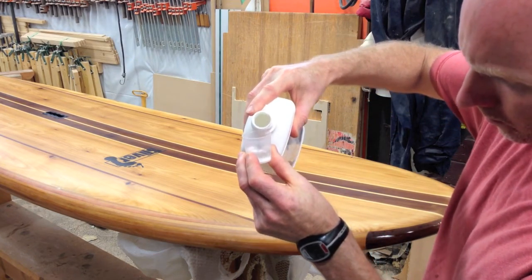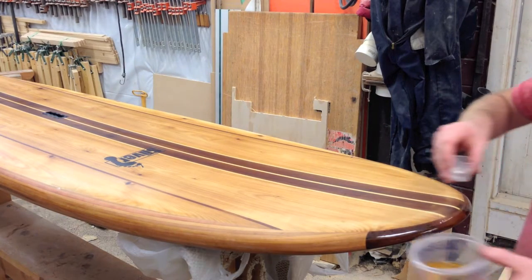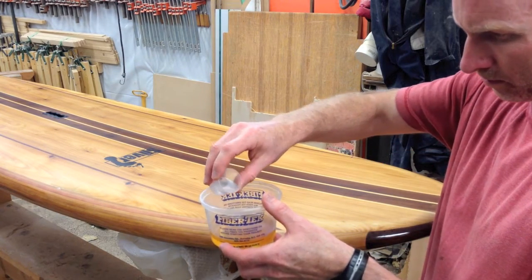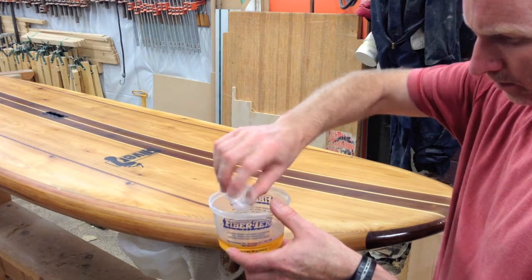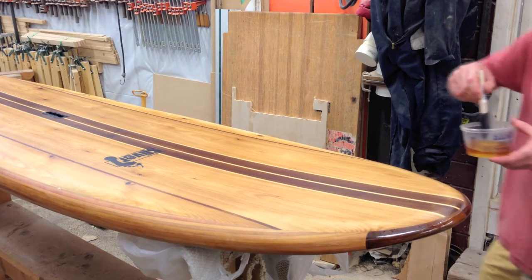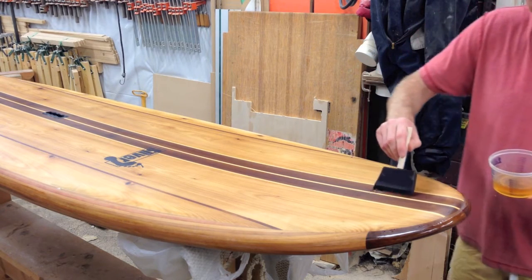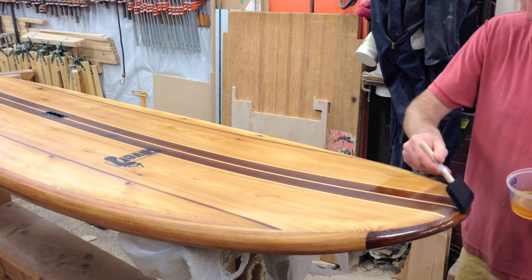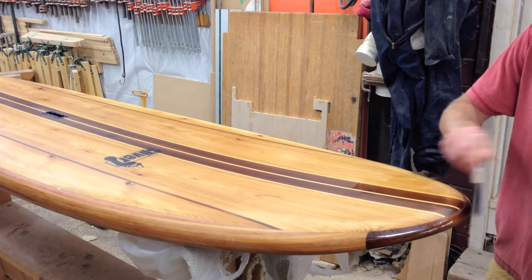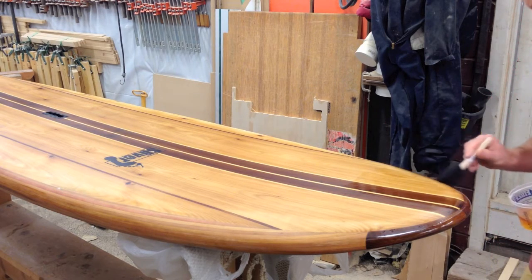So now I'm measuring some of the thinner to thin my varnish. I don't have a specific ratio because each varnish brand, and even the same can as you use it, changes: the thinner evaporates out of it, so you have to add more. Basically, once you figure out the consistency that you need for your varnish, thin it that amount. I just use the measuring cup as a rough gauge so that from one batch to the next I can have consistent results.